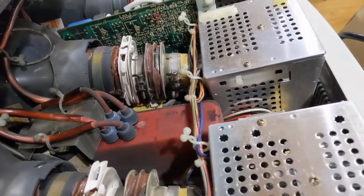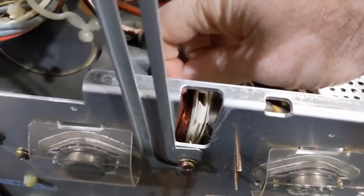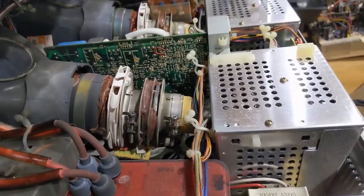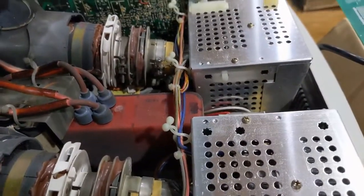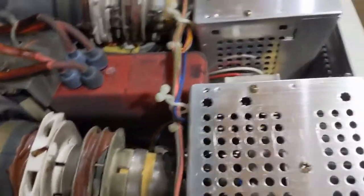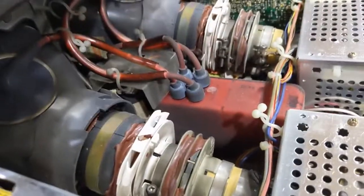This thing's got some hours on her and it's got that stupid circuit glue — they're using that corrosive circuit glue to hold things down. There we have the power supply, and it looks like it's got a bodge wire on it. These are the video neck CRT neck boards. Those CRTs are thick. That's the high voltage splitter, and that might even be the flyback as well — nope, flyback's back in here, you can see it.